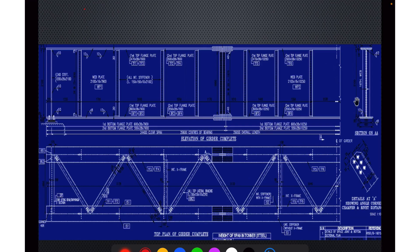The upper figure is the half section elevation of the girders. As you can see, the girder is resting over the bearing. This is the plate girder cross section, and we have stiffeners at various places. We also have the splicing arrangement shown — when a girder is fabricated in parts, it has to be assembled at site with the help of splices. This is the basic arrangement of a plate girder.